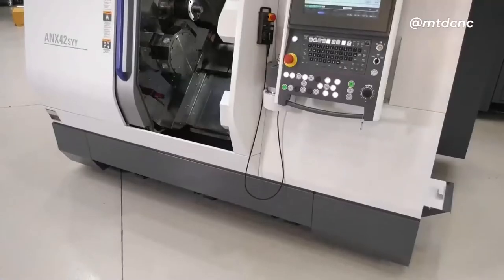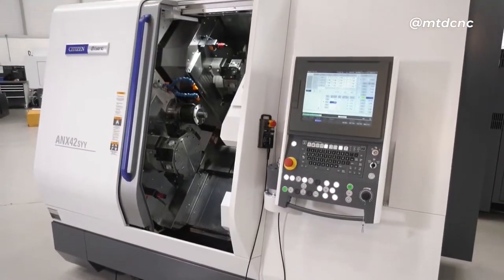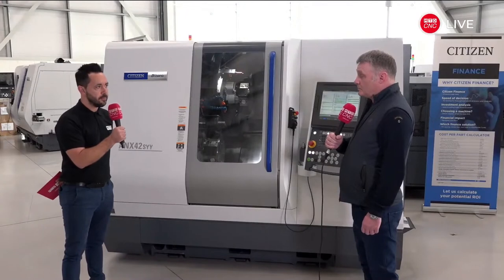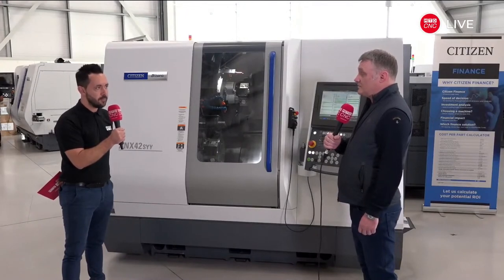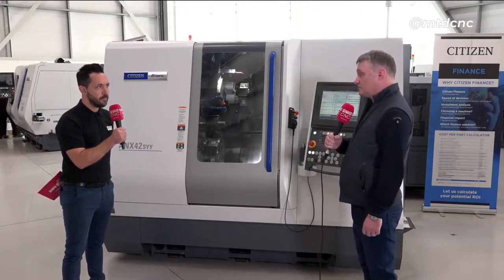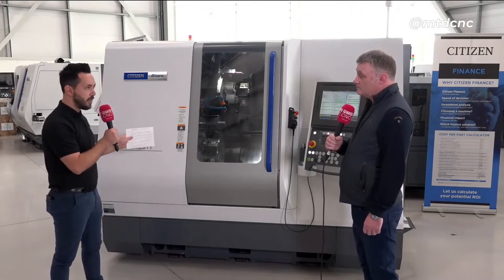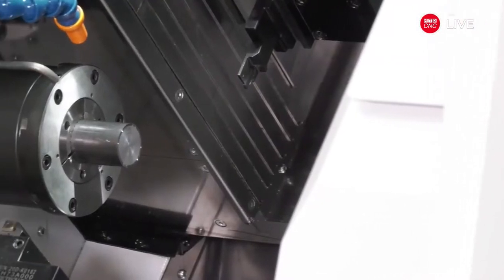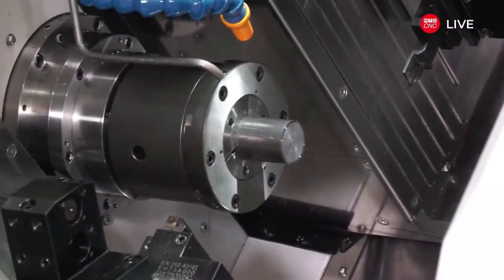You mentioned capabilities — tell me about the new capabilities of this new Miyano, please. Well, twin spindle, twin turret, both turrets have got y-axis, and what really attracts me is the x-axis on the sub-spindle. So what that means is the second spindle is actually moving in the x-axis and the z-axis to give you even further capabilities? Yes, we can machine offline with the sub-spindle on either turret, which will add more capability to what we've already got.